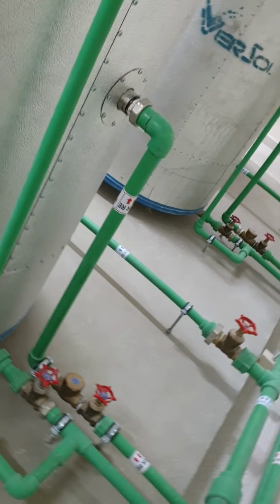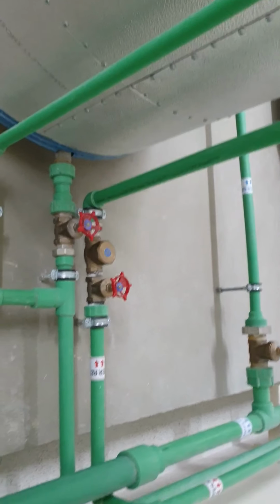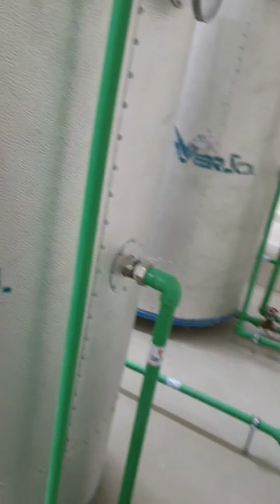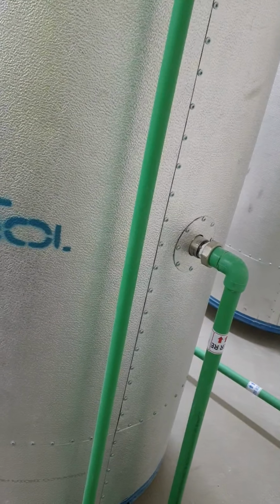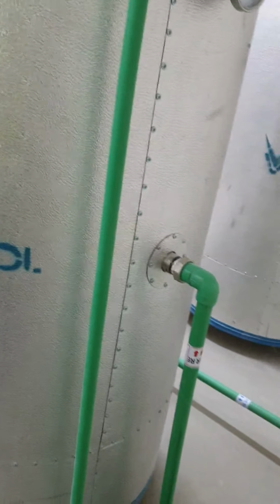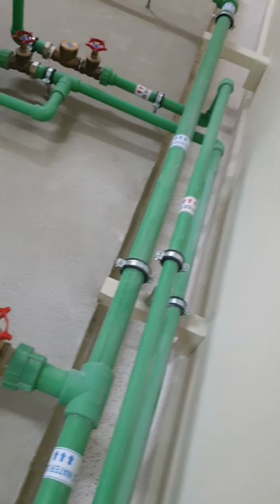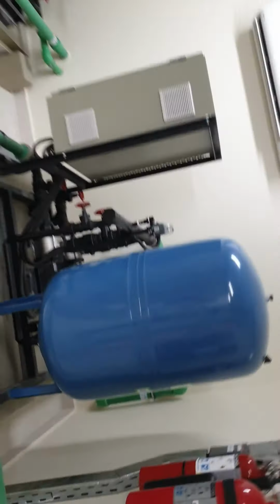Now, the piping is done with enough safety. There's a PRV, NRV circuit. There's an NRV on the hot water line to avoid backflow. When the temperature of the storage tank gets higher, the pressure will increase, and this can cause an automatic backflow of hot water to the cold water line. They have used an NRV to control that, and of course on the cold water inlet as well there must be an NRV. This is the hot water, cold water supply line. There is an NRV to avoid that, and there's a building booster pump for the cold water inlet.